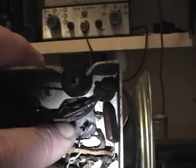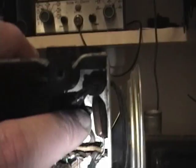I think I'll just need to replace this and that should take care of the problem. I'll take a q-tip and use some alcohol or lacquer thinner to try to clean that up a bit so it doesn't look quite so bad. I've just about got this electrolytic freed up — it's got one more of these twist leads to unsolder, and then I'll pop that out and start rebuilding it.